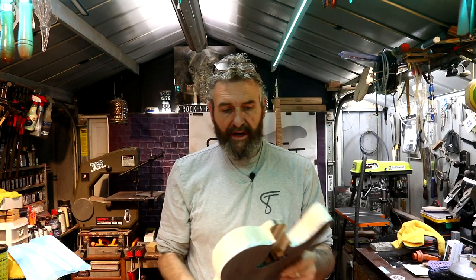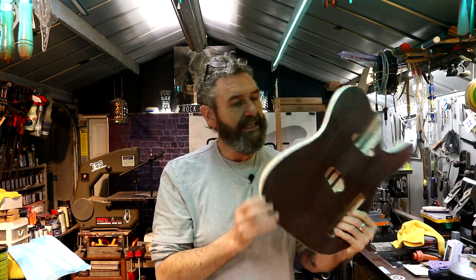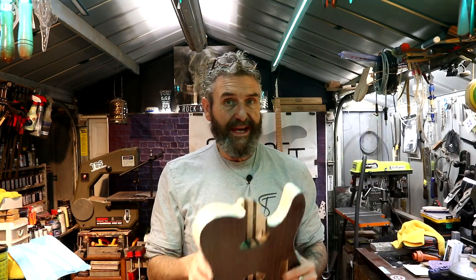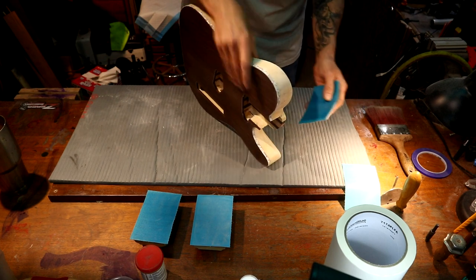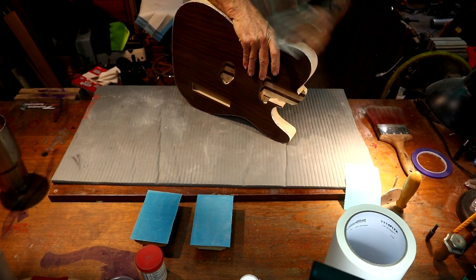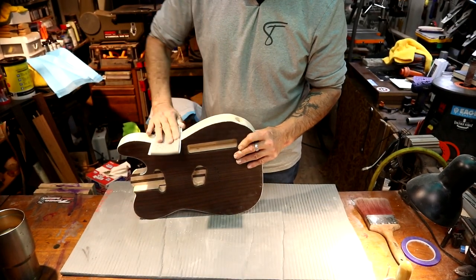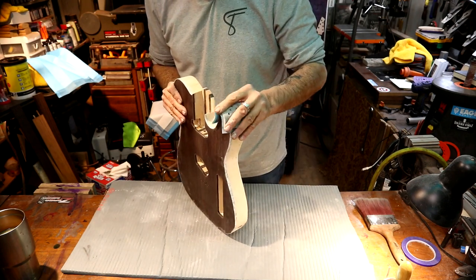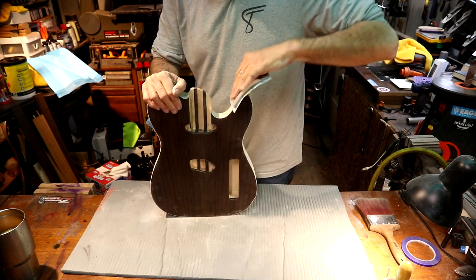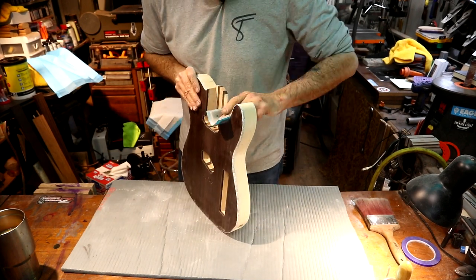I've got all that excess putty sanded off with 240-grit. Now I'm going to change over to 360, get this back nice and flat, make sure our sides are right, work on the top as well, then tape this thing up and get ready for paint work. I'll start on the side of my neck pocket and all I really want to do is get rid of those 240 scratches. As a general rule, when I think I'm done sanding, I'm probably about halfway there. All in all I've probably got about 10 hours in just sanding work.